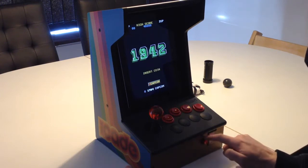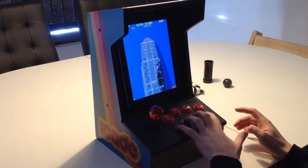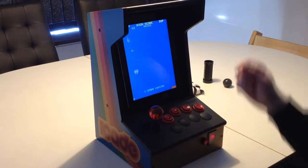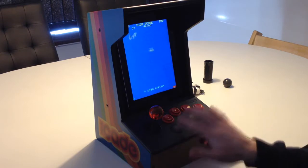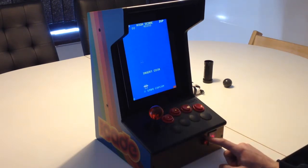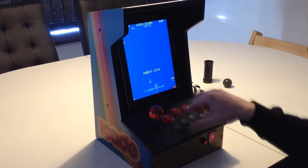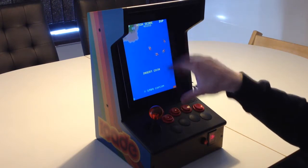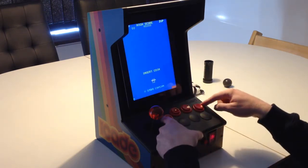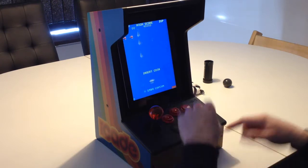I've added an extra button down at the bottom, because in order to pair it up and communicate with the iPad, you had to hold the 4 bottom buttons and button number 4 at the same time, then the lights blink and the iPad can find it. What I did was move the bottom row up to the top. So now to turn it on you hold those 4 down, but I was missing one button so I've moved it down to the bottom. To open the menu inside MAME to change buttons and dip switches, you used to press 2 buttons simultaneously, but I've moved those down to 1 button at the bottom. So pressing those 2 now brings up the menu, and pressing all 4 lets me pair it with one hand.